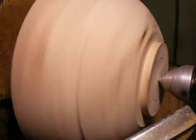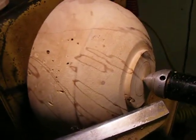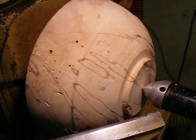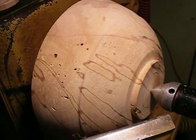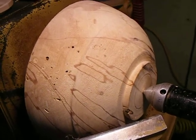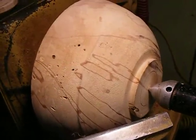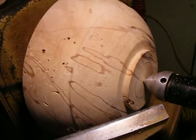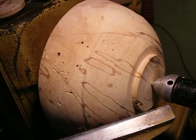That's how I do it. It's just a simple little jam chuck. I hope that helps you out — give it a try with a lot of your stuff. I'll do this side first, then flip it over and grab the other side to finish the inside. And when it comes time to putting a finish on, I'll put a t-shirt or a cloth on the inside to protect it from getting scratched up. This works really well for doing the back side of bowls and reducing your tenons.